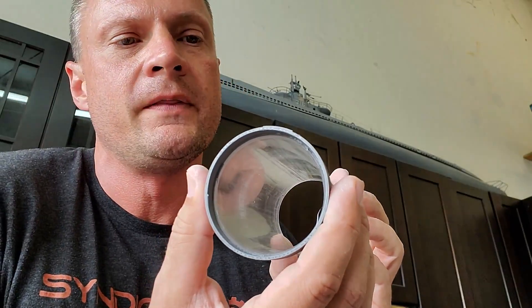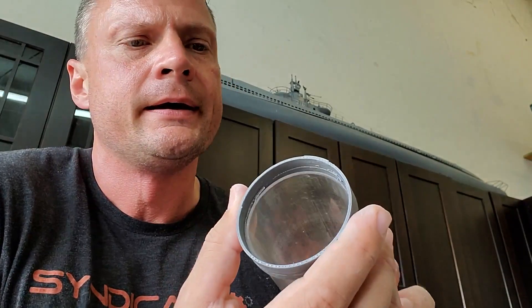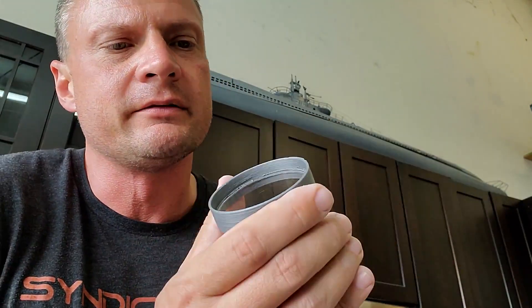That creates about a 45-degree bevel and should be nice and clean. Ends are chamfered, and I'm test-fitting the support ring — it has good tolerance, tight but not too tight. I'll clean up the edges a little more and then break out the two-part epoxy. Before gluing, we're going to rough up the perimeter with coarse sandpaper on both sides so the epoxy has something to bite into.